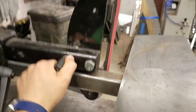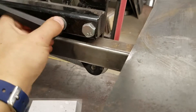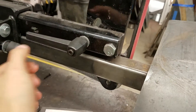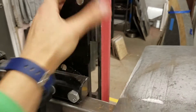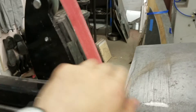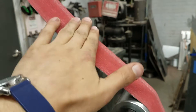You can also adjust the angle — loosen here. All of these levers work the same way: if you've tightened it down but want a different position, pull them out and put them in another position. So loosen it and now you can adjust this angle to be wherever you want depending on what you're doing. There's also a generous slack portion up here — there's a hard platen behind that you can push against, but sometimes you want the belt to conform to a shape, so this is the slack portion without a platen that you can use.